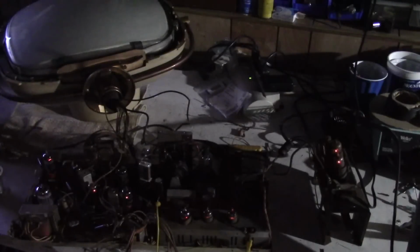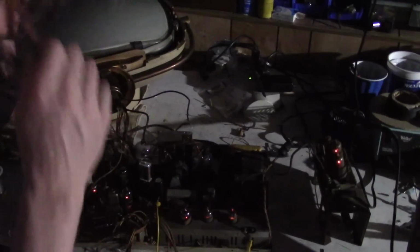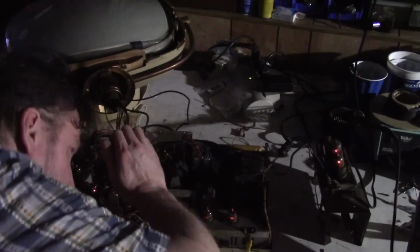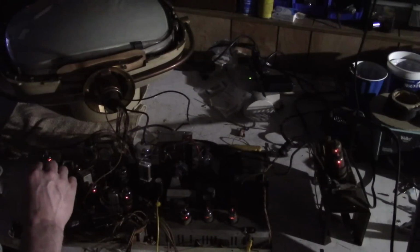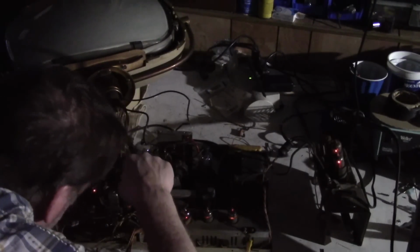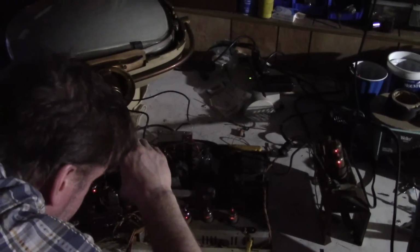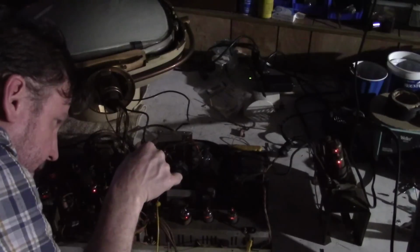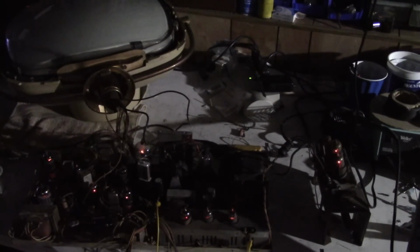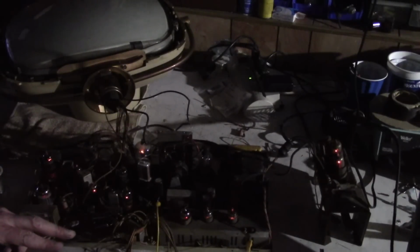Let's kill some of the lights. Tuner lights, the IF tubes, it looks like the damper might be out in the horizontal output tube, and this 6CG7 maybe? No? Oh, okay, there goes the horizontal output tube. I'm thinking we could have some kind of bad socket connectivity. Well, since I've got that spare chassis nearby, I can swap some tubes out. Looks like we just have two tubes that aren't lit up right now. Alright, that's something.